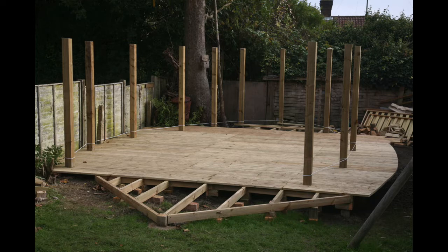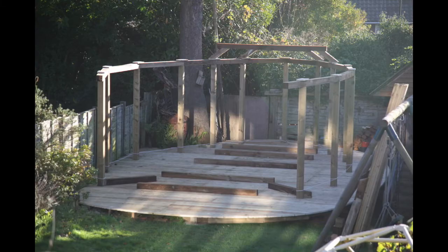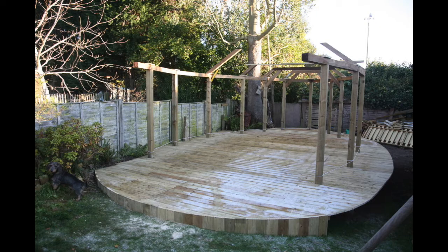This was just sawn with a jigsaw. I then added the beams around the top cutting the angles as I went. After laying more decking boards I shaped the curve of the front, and then you can see I started to add the angle supports and the beams that are going to form the roof. This photo shows how I was able to form a really nice platform just by using decking boards vertically around the front edge of the curve. You can see further angled supports and cross beams going across the roof as well.